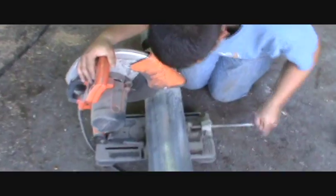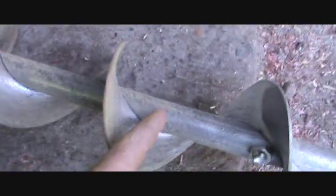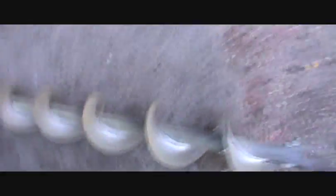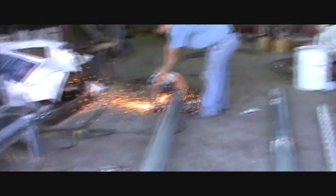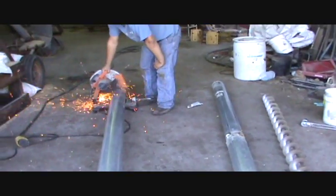I have wagon loads of corn here that need to go. I'm going to be repairing this — I got it out of here just a little bit ago. I've got Tim cutting that tube there. I'm going to take 32 inches off because I've got to remarry these two pieces of auger together. I've got to cut it about there, and we're going to re-weld that all back together. I'm going to run a little bit of a V weld around both holes. He's cutting that tube, I'm going to get the welder going, and we'll put it back together again.